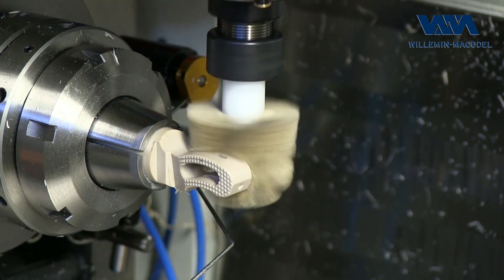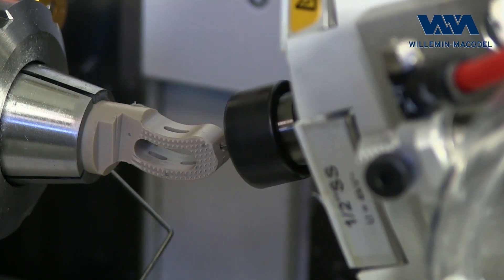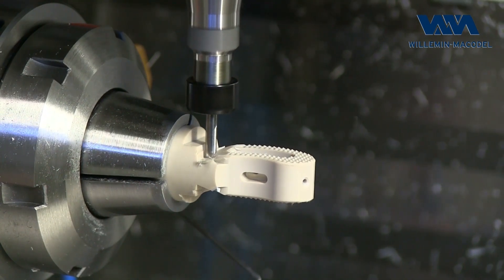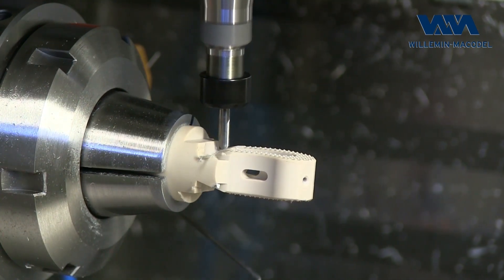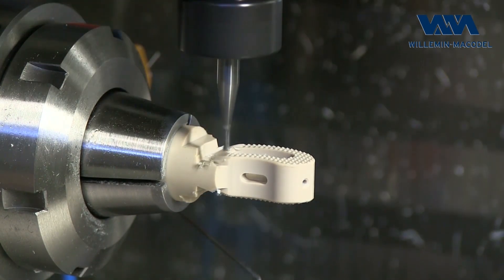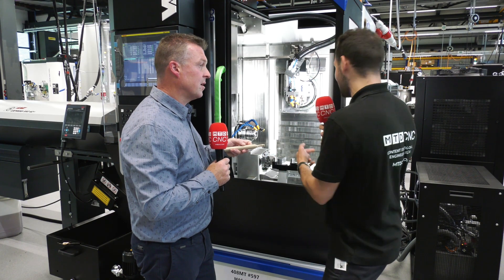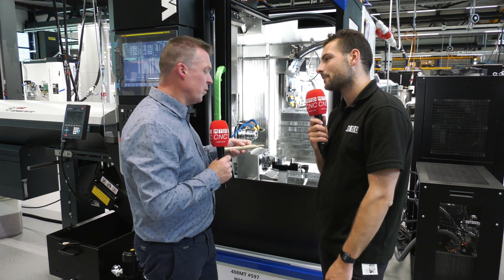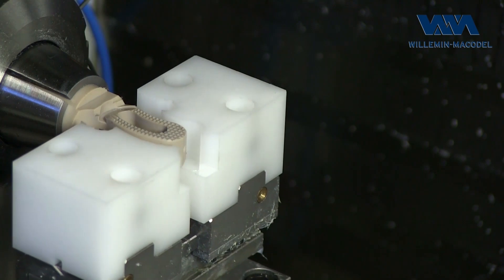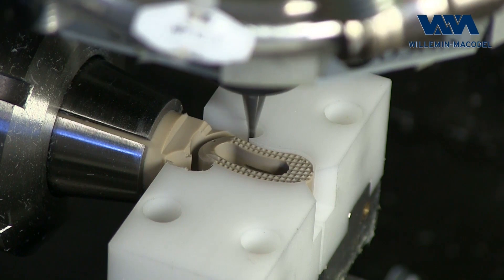And if these parts are slightly different dimensions but still fit within 36 millimeters, you could make one, then another of a different kind, another of a different kind — out of a three-meter bar length, maybe 200 different parts. Exactly — only the vise has to be compatible for the different parts. We need a common surface to grab the part with the vise, and after that the machine will be autonomous — it can work alone during a night, during a weekend, as you want.